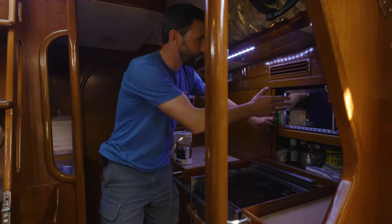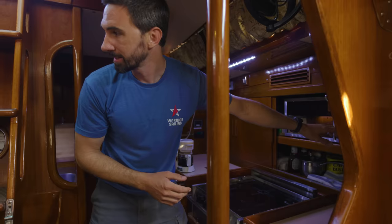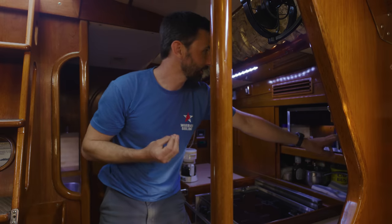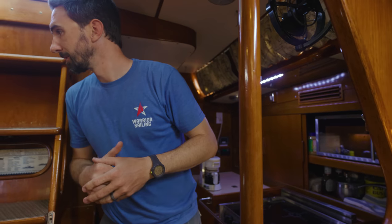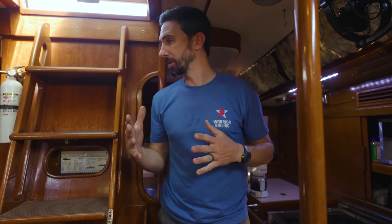Over here I have a microwave. My baseline load right now is about 15 watts of power being drawn on my outlets. I'm going to put this on for a minute. Looking at my loads, I've gone to what looks like 1,200 watts — that's a lot of power. So minus the 14 watts initial, I'm drawing about 1,190 to 1,200 watts. It's quite the load — a lot more than the lights — but the beauty is you only run the microwave for a couple minutes at a time.